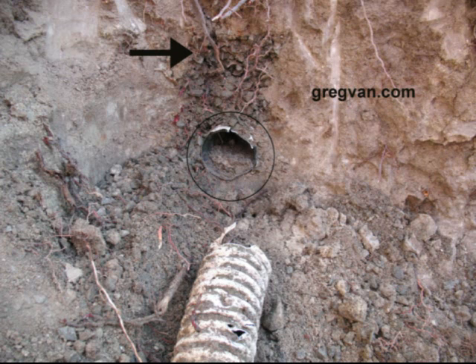Because they deal with that stuff on a regular basis. Look at all the dirt in there — the gravel does not keep the dirt out of the pipe. The gravel just provides extra area for the dirt to eventually settle into, like you've seen in the pipe.